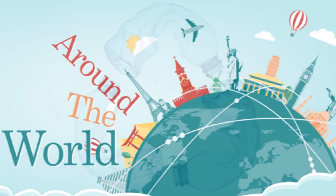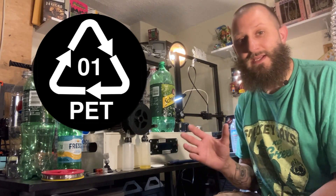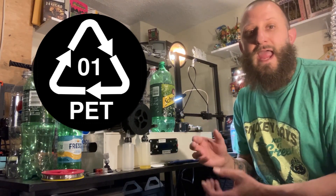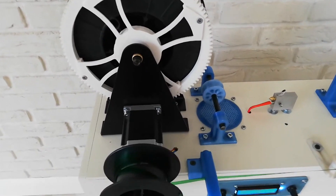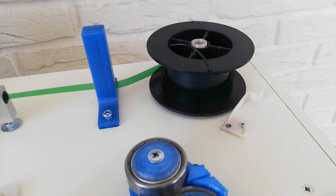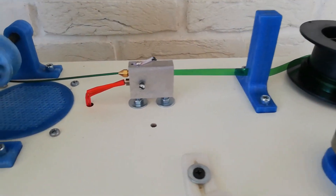What makes this so special is you can take any soda bottle or water bottle — PET recyclable number one — and this is going to strip it down, spool it, and then you take that spool of strip and put it through a hot end which converts it into 1.75mm filament, or as I joke, about 1.6mm.